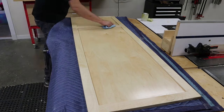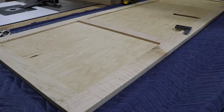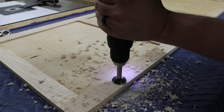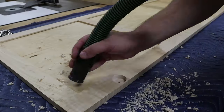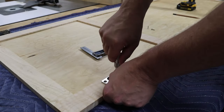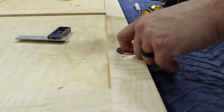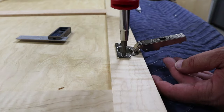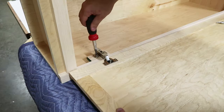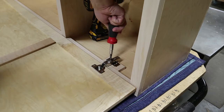It's not super durable so I don't recommend it for cabinets in a laundry room or a kitchen, but for shop furniture this is just fine. I then began laying out for the hardware — in this case, I used Euro style cup hinges. I explained this process in my door making video, but I will say that you should follow the instructions that come with your hinges because they will all have their own placement and depth requirements to install correctly. Now once I got the hinges installed on the door, I lined everything up and installed the cabinet side of the hinge on small blocks that I attached to the inside of the face frame.